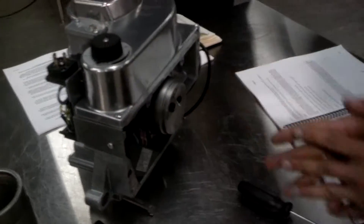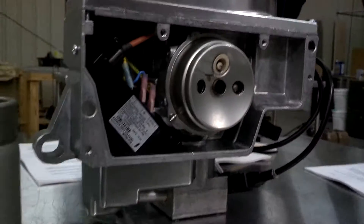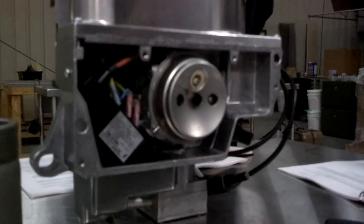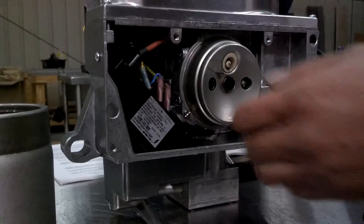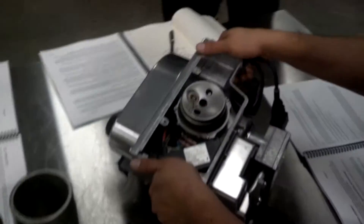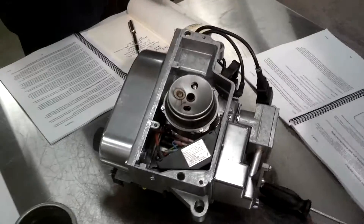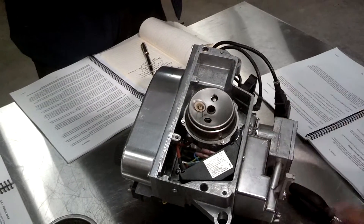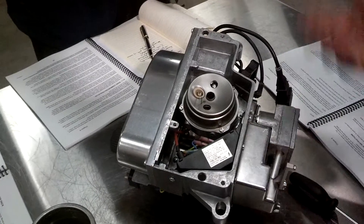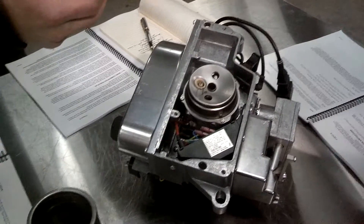So the reason I took out the front flange and flame tube air tube assembly is because now it gives me access to the atomizing chamber, the transformer, and essentially the photocell. To replace the atomizing chamber, you don't really need any tools — it pops right out. What I like to do is lay the airtronic burner on its backside. When you're doing this, make sure the burner is completely drained — the sump is drained on the airtronic burner so there's no residual fuel inside. Because if you don't, and you start turning this thing upside down, you end up with a big mess. Drain the burner first — very, very important.